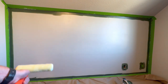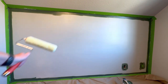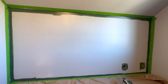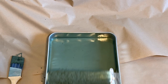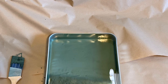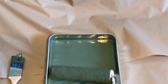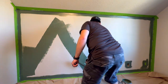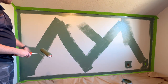You might typically think to just go up and down and make your way across the wall, but if you actually do a pattern where you put some on and then go in a W all the way across the wall first, by the time you go up and down you'll have a much better spread and won't have to use as much paint. Get a nice layer of paint on the roller - not too thick but not too thin, just a good coating. You'll notice as we go up and down there's less to fill because there's already some green on it.